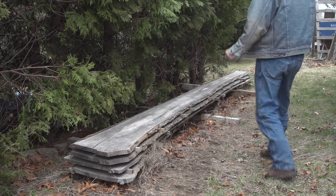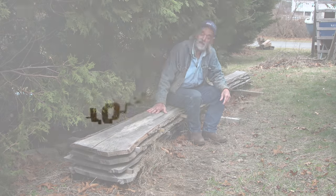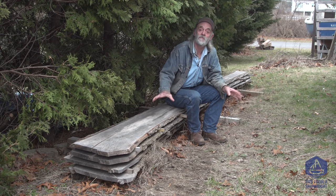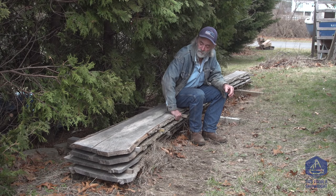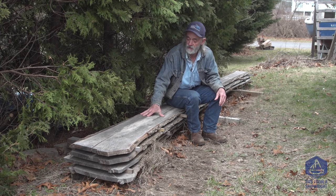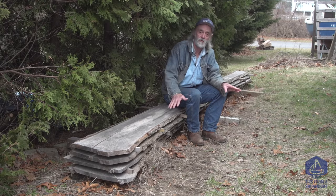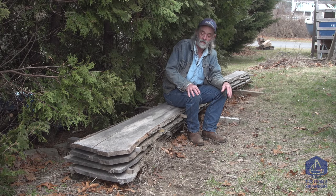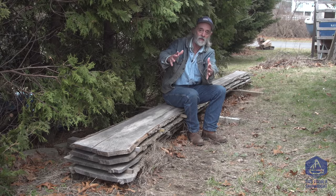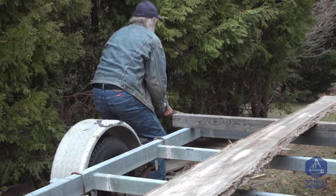We're back here where it all started in my backyard, sitting on the same pile of lumber I introduced you to quite some time ago. This is what's left of it — four pieces. I had picked this out to be the gunnel caps. It was sawn fairly thin, and this narrowest piece will be a little difficult to get the best use out of. But there's some pretty nice lumber in here, and it's going to be the gunnel caps. The whole gunnel to me includes the in-whale, the gunnel cap, the guard, and everything else.